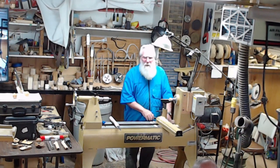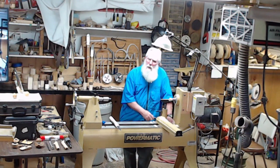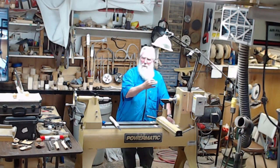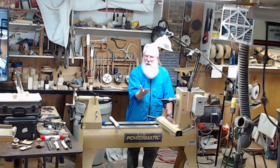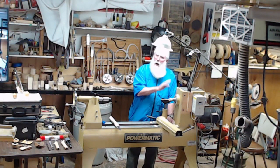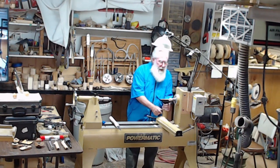To be exactly that thin. That's pretty much perfect. I'm saying probably about a little less than an eighth inch. What I want to do is I just want to get some meat out of there, and with that shape of that squatty sphere, what's happening is when it spins, it's going to give it a little bit of centrifugal force and start rolling up on its side. And if Peter has enough hollowed out in there, then it'll come up and spin on the handle. So that's probably about 3/8 of an inch deep or so. Oh, the instructions for this are also on my website in a little article. So now, before I sand it, I'm going to just start shaping a little bit.